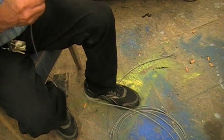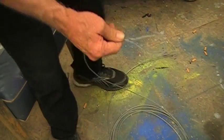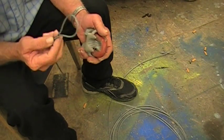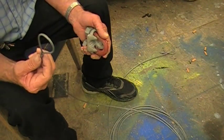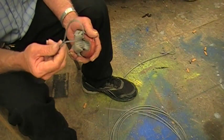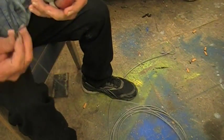Now what you can do — this is a little large, but it's mainly so that I can show you what it does. On a cable, if you just put tape around this, it's pretty strong for light work. It'll more than withstand half of the safe working load of this cable. But if you're going to pull a real hard pull on this thing, I mean to its max, then you would want to put a cable clamp — a little smaller than this, of course, the right size.